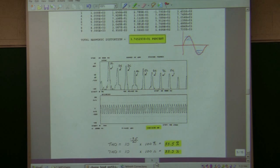But again, what I'm seeing is harmonic content that is everything, the even and the odds together. And that's going to give you a fuller sound. And the transformer actually also has distortion. I did one test some years ago on the Tweed, and I have a simulation of that one too.